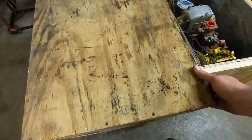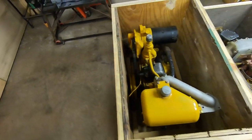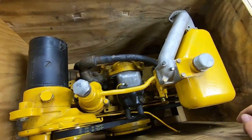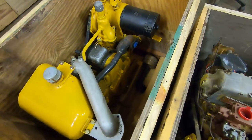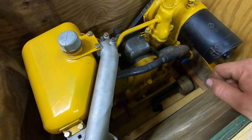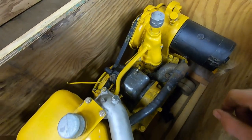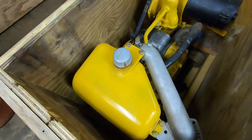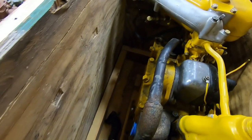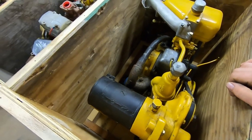Getting into the bigger crate — this should be a rather complete one that was running. I kind of forgot it had electric start on it. This one was running when I bought it, so the seller built a little test stand with some coolant and ran it. He'd been through it and had to make his own crank bearings — used some bronze, which I'd probably go back and replace with proper aluminum ones. It has a newer replacement Wico mag, a U-series fuel tank with air cleaner crossover, the complete correct Zenith carburetor, and what looks like a lawnmower muffler he put on there.